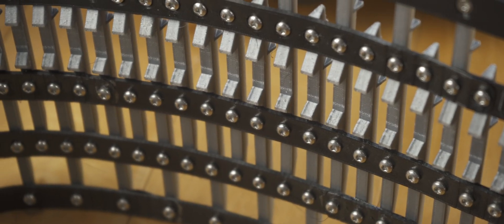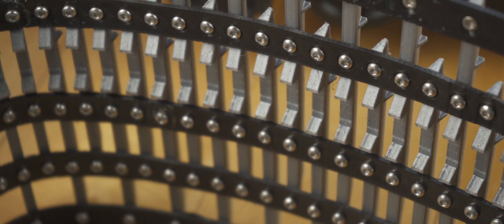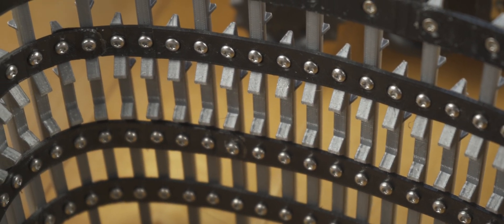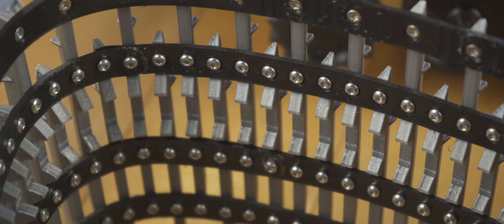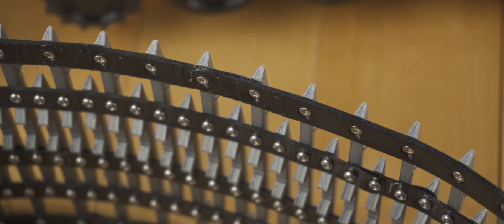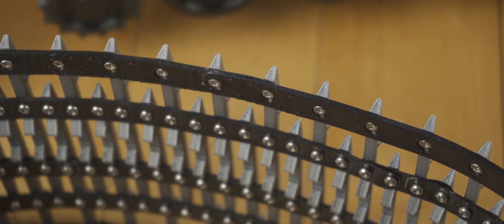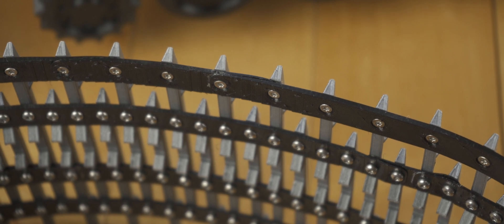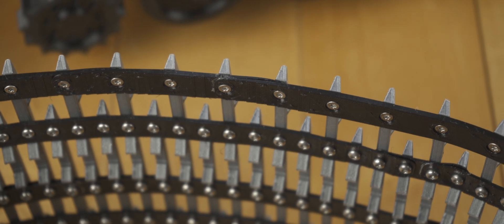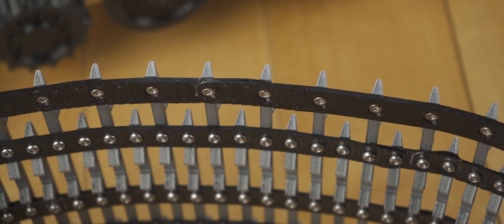The tracks are completely 3D printed. The silver parts are printed out of PETG, although all hard plastics will work, and the black belts are printed out of TPU. I recommend using 80A to 95A shore hardness TPU. The belts are made of multiple strips which have a taper where they can be glued together. Make sure to use a flexible glue. The innermost belt uses M3x5 countersink screws and the other ones use M3x5 dome head screws. The countersink screws prevent the screws rubbing on the aluminium plates. The chain consists of 78 ribs connected with 5 belts.